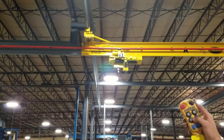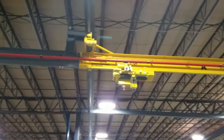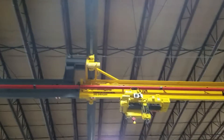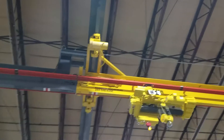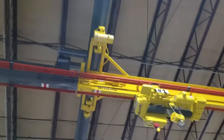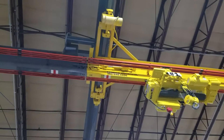The reflective tape on the bottom of the bridge and the bottom of the spur is that safety circuit. If the hoist is in that circuit at any time, the end stops will not go down.